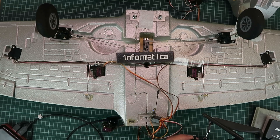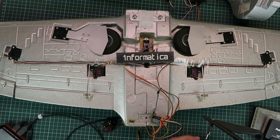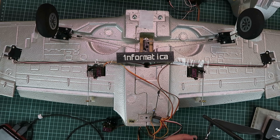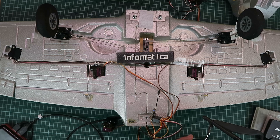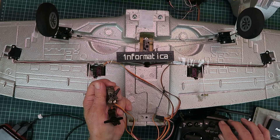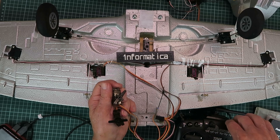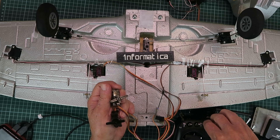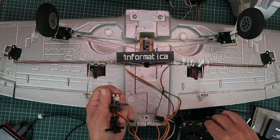I've programmed up my transmitter and on this switch here is the landing gear. On this switch we have our flaps at half deployed and fully deployed — remember that is on two separate channels. I still of course have aileron movement from the gyro, and although you can't see it you can hear that I still have elevator and rudder on the main model. The other two channels? I just put them on these two servos mapped to the two potentiometers — I've actually run out of switches, can you believe that? There we are on the other channel: center position, one way on the other, and similarly on the other little servo.